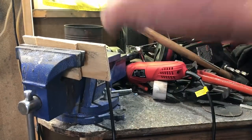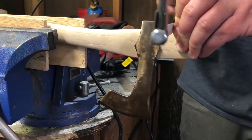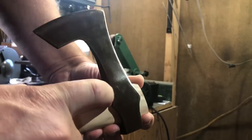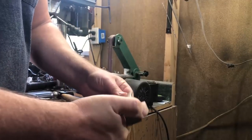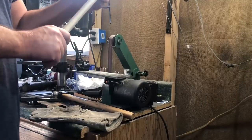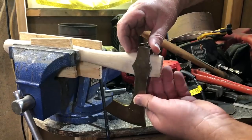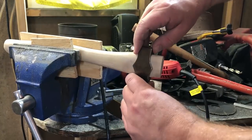Then I started fitting the head to the handle. What I learned immediately was that the handle was definitely a little too narrow and too tall, so I had to take off some of that height. And because of how narrow it was, I really had to drive the head down into — I'm not sure what that part of the handle is called — but the part that sits right below the axe head. It's a little thicker and stronger because if you miss when you're swinging, it has to be able to take a blow. In order to get the eye of the head to fit, I had to drive it down into that area. There was a lot of work here that would not have been necessary if I had picked a correct size handle to begin with. But in some ways it was actually beneficial because it gave me experience similar to selecting a piece of hardwood and carving and shaping it all myself.